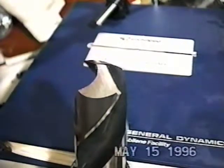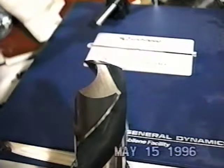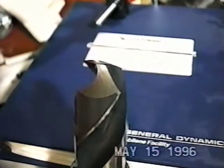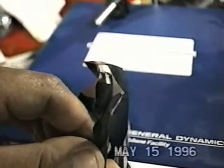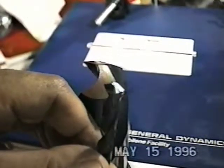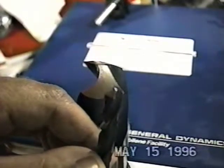The next thing we want to do is look at the finish of the drill. We don't want any burn marks. We don't want any striated rough-looking grinds. We want something that looks smooth and pretty. The drill that we just ground was the three eighths inch drill, and you can see the real shiny surface to it and sharp cutting edges.